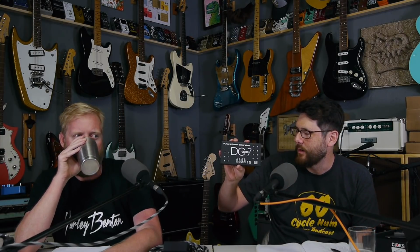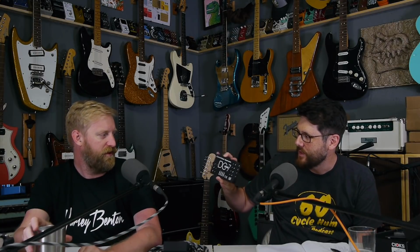Also, I know, again, stupid features, but all of the switches on the front are dip switches to select your voltage. And it's got the little map there so you know what you're doing. Part of that design is because on a lot of other power supplies with voltage switching, it's just a standard toggle switch, so it could get bumped accidentally. If your board's sitting on carpet and you push down on it and slide it, all of a sudden you're delivering 18 volts to your delay. Yeah, seriously. Anyway, too much excitement over a power supply.